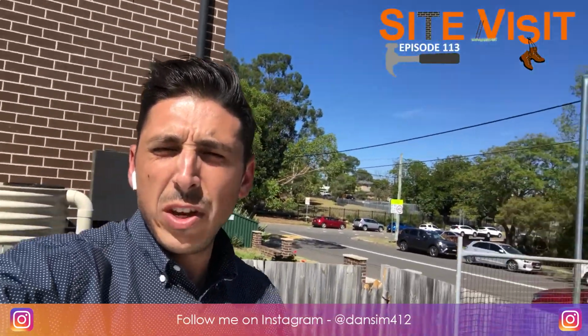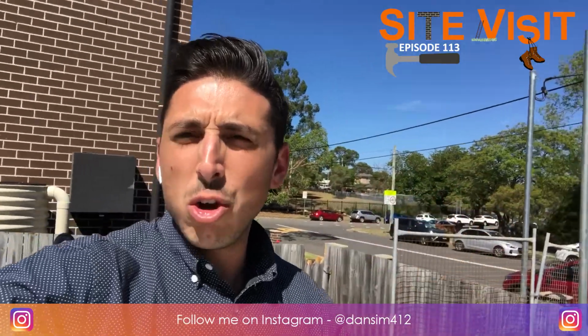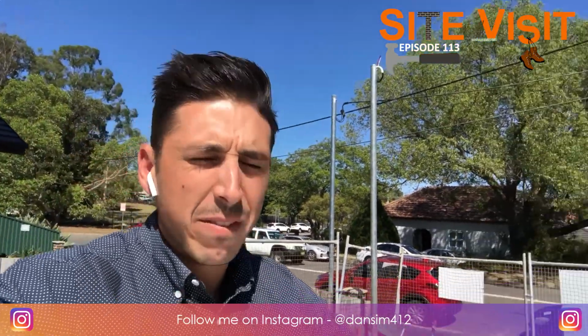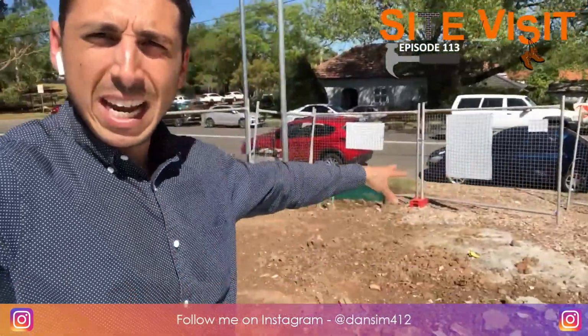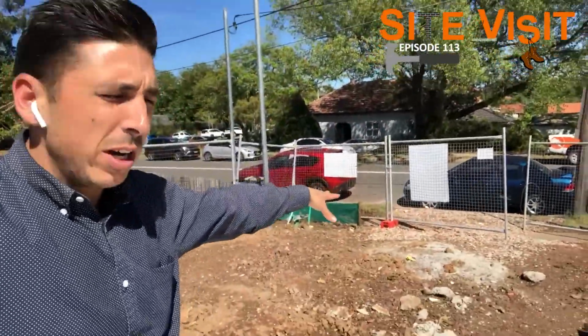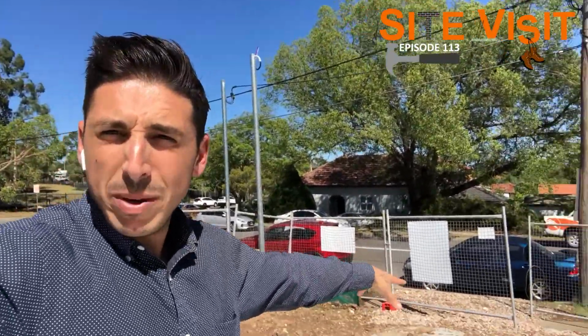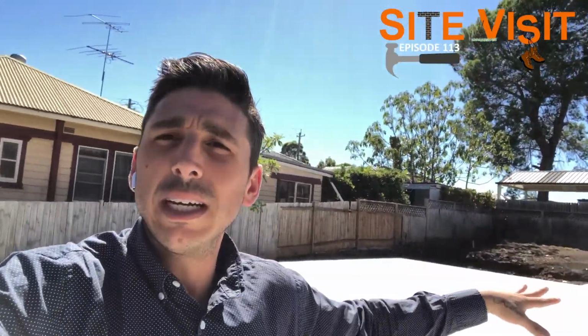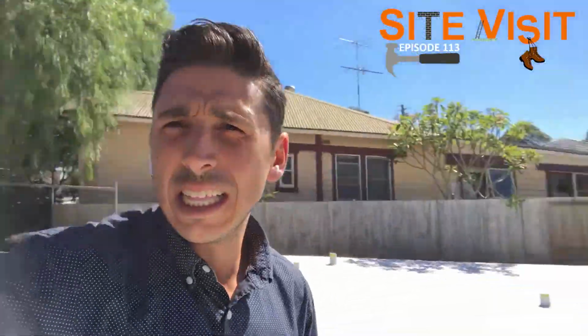So guys, if you know anyone who has a little bit of a slope on their block, and you may not think that the slope they have is going to be necessary for them to have the drop edge beams to help their garage out a little bit, definitely tag them in the comments below, because this will help them understand how you can minimize having a really slopey garage, and minimize having retaining walls at the back of your block. So instead of having split levels in your house, that might be an idea just to drop the garage down slightly, have a few steps there, so the remainder of your house can be nice and level.